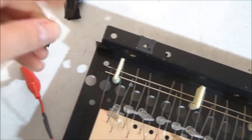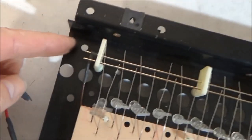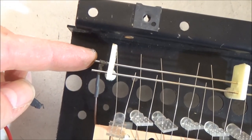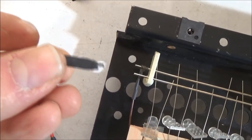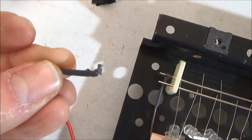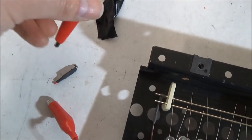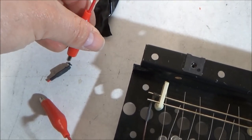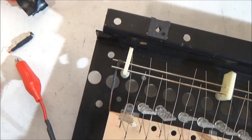So it was just what I thought. The little connector here that connects the wire to the bus bar, it slips on and off. It broke, and it's common. These are really lousy connectors to begin with. So what this person did was they clipped one end of an alligator wire onto it, wrapped it in electrical tape, and then the other end of the alligator wire was clipped onto the bus bar.